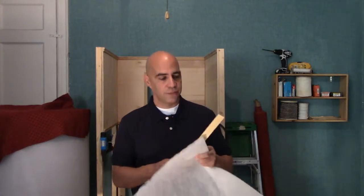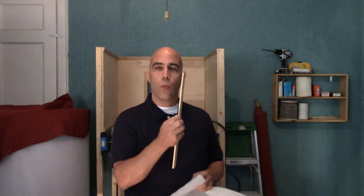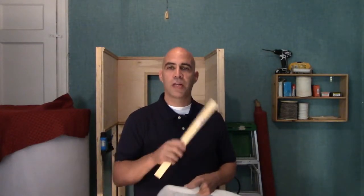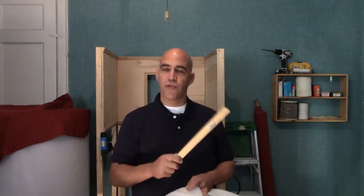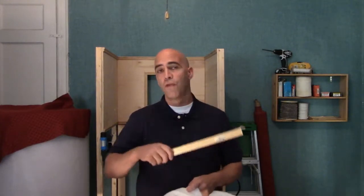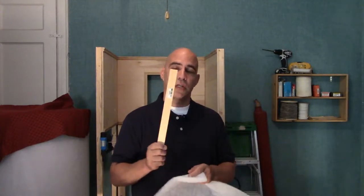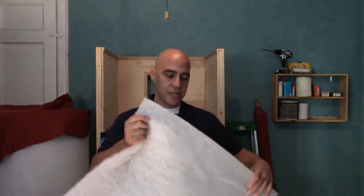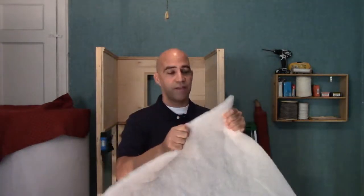So the materials you're going to need for a traditional wall upholstery job are wood lattice. This is about 1/4 inch thick by 1 1/8 inch wide. This you can get at a lumber yard like Dykes or Mensch. I would recommend getting it in a lumber yard over the home improvement stores. It's a lot cheaper, a lot more cost effective. You're going to save a lot of money. And you're going to need Dacron. This is 1/2 inch Dacron. This is also available from Van Wyck.